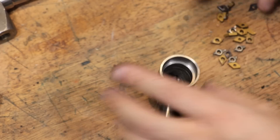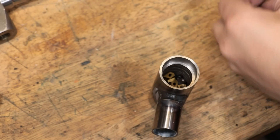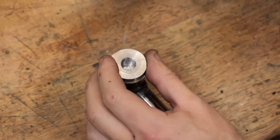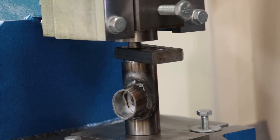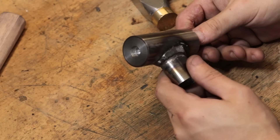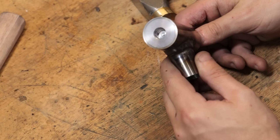So what I'll do is I'll fill it about three quarters of the way up. For the dead blow hammer to work it does need this extra bit of space — there needs to be a bit of space for the inserts to move around, to cause a delay when I strike the hammer and hopefully distribute the striking force over a longer period of time. Well, hopefully anyway, that is the theory. So with all that now in, I can get the cap started and then go over to the press and press it in place. Now that fit was a lot tighter than I was going for, so I think that should be able to hold by itself. I'll give it a go and see if it loosens up, and if it does I can simply weld it in place or just pin it.